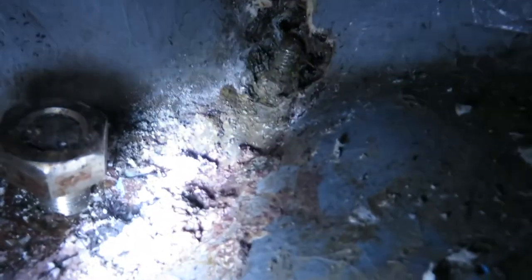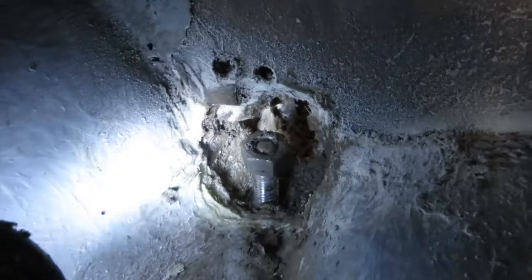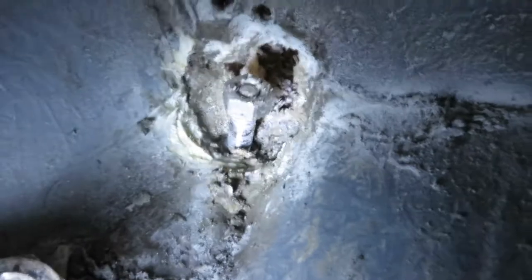In fact, it was completely sealed in. Finally, I got there after almost two hours. You can see the hole that's been dug out of the section of wood and fiberglass. From the starboard side, there's absolutely no evidence that there's a bolt there at all — you can't even see a bulge or a nut sticking out. So now's the time to cut this area away and see what we can find. Hopefully we'll find the bolt that we require and undo that.